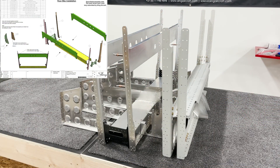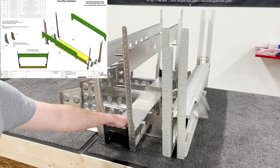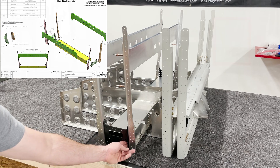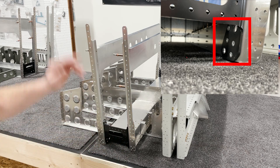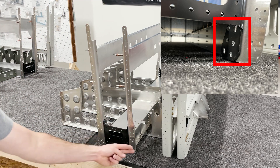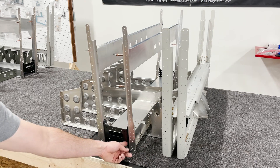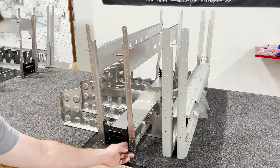For this next step, keep in mind that all of these components go to the inside of your gear channel. The bottom four rivets on both sides need to be countersunk and the rivet goes from the inside out. That makes sure that when we install our gear leg there's no interference on its way in.